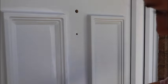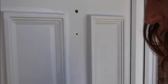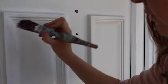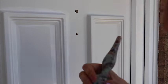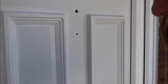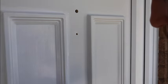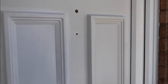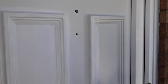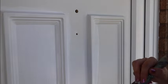Painting white on white is unfortunately not the most visible or interesting thing to see on camera, but that is the first and probably most important step of this process. This is Slick Stick — it's sort of like a primer, but it's essentially what you put under something shiny to mattify it and give it a matte coating so that paint will stick nicely on top. This avoids having to sand. I've used this on my fridge — a metallic surface — and it worked brilliantly, and also over wood veneer that I felt was too delicate to sand.